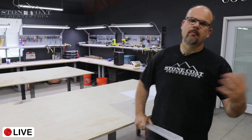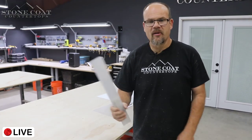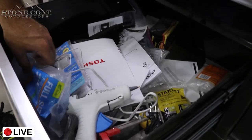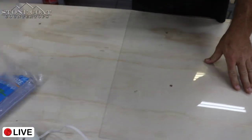I think acrylic's gonna be perfect for this craft style project. It wouldn't work so well on a giant river table because acrylic's expensive unless you can reuse it. So because I can reuse this over and over again on a small project with hot glue on the strips, I think it's gonna be the perfect tool of choice. Let's test it without any spray release and see how well it comes off of this mold. Does this acrylic make me look better?